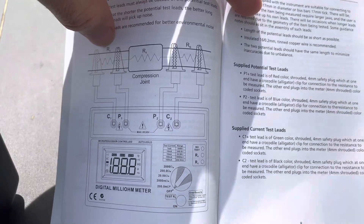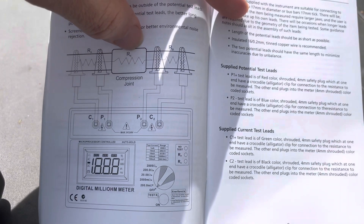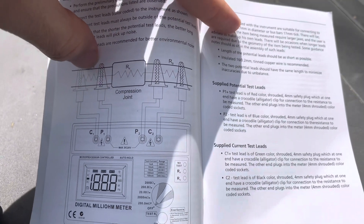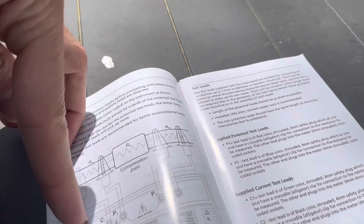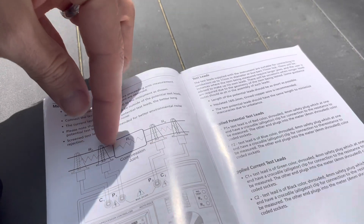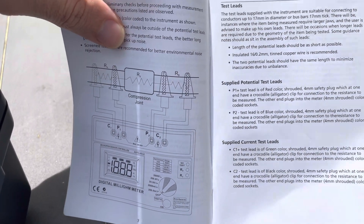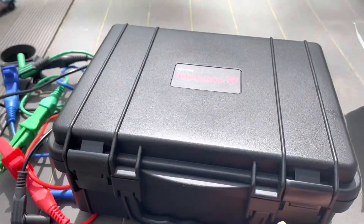You're going to have two test leads connected to one side, the thing you care about — the resistance Rx — in the middle, and then two test leads on the other side. The reason this is unique is because we have four leads. The instrument itself will actually cancel out the resistance of the two leads on each side, so that when we're measuring resistance we're really just getting the resistance across the component. That's the theory behind the higher resolution in resistance and why you care about this.